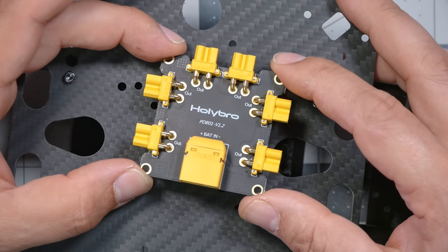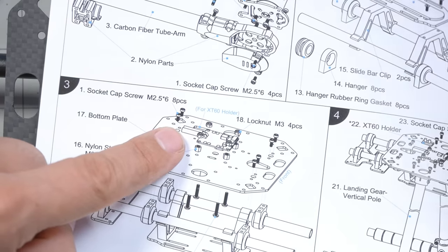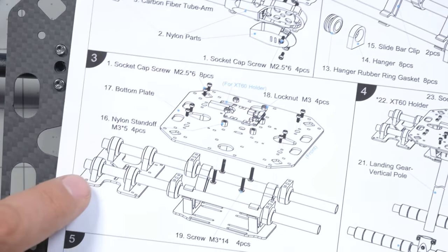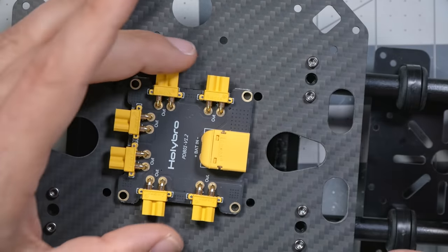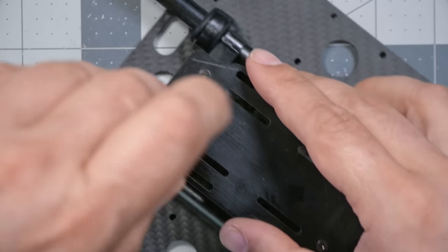This looks like the power distribution board — I can see it's got a soldered-on XT60 battery lead, and solder pads where the ESC power would go. In our case, our PDB looks like this: it comes pre-soldered and has plugs instead of solder points. It must be what the instructions are referring to, even though it doesn't exactly match the pictures. The XT60 lead faces the side of the drone and lines up with these holes here, with standoffs underneath. This probably would have been easier to do before installing the battery plate.